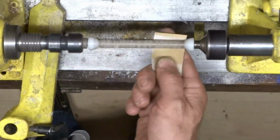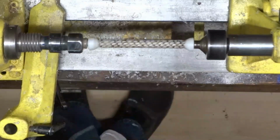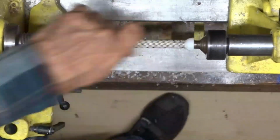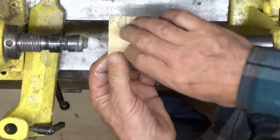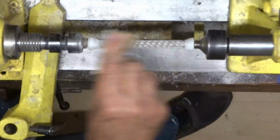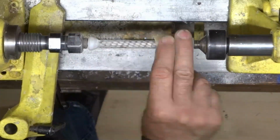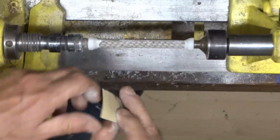So now I'm sanding down the high ridges because they got pretty built up with this many coats. I started with 220 grit sandpaper, and that was kind of a joke. So now I'm using 80 grit, and I don't want to sand through. I don't want to get rid of all the shiny spots like you would normally do if you're flattening it out. I just want to get rid of the high spots, those big giant ridges. And of course, since I started sanding, now I have to sand out all those scratches. Otherwise, they'll just get sealed in with the more coats as they get applied.